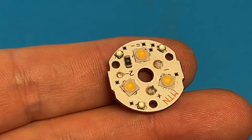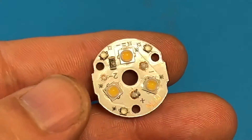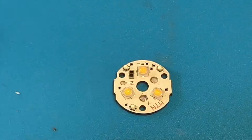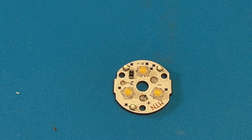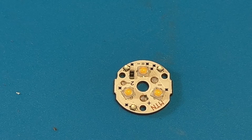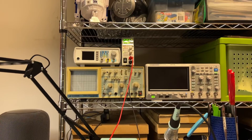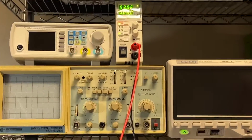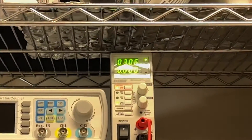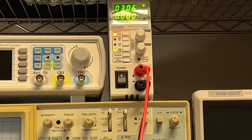This is especially important if you're soldering three or more emitters, because just one bad connection can ruin the whole experience. I don't actually have a digital multimeter with the diode setting — I have a good one but it doesn't have that — so what I've been doing is just using a bench power supply.